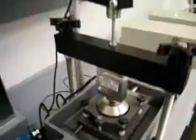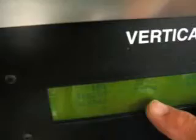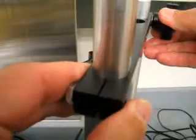Now the little displacement sensor — we need to get it positioned properly. So we go to monitor, debug, and then we are going to try and match these two numbers right here as closely as possible. The value should be about 30,000 — about 32,000 or 33,000. So I'm pretty close to that right now. If I need to move it, I can adjust this arm holding the displacement sensor up or down to the approximate position where I am at about 32,000.